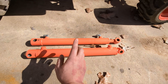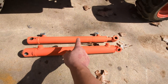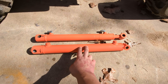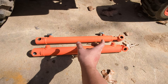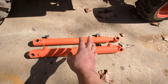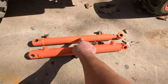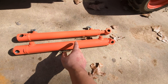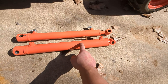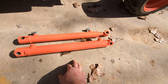Let me talk about what these look like compared to the stock ones. In my prototypes I got about 11 inches more - it was 65 inches with stock and about 76.5 with the HydroPlus prototype version. As you can see, this is a larger bore: 1.75 versus 1.5 on the stock. The 1.75 bore is the same size you get on the LA525 from the factory. That means at the same pressure, this cylinder will push as much as the stock LA525, which is on a much larger tractor.